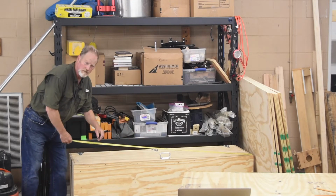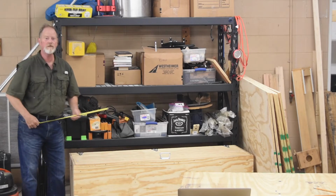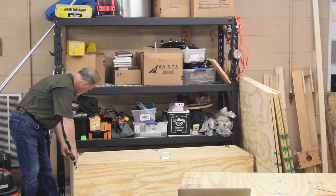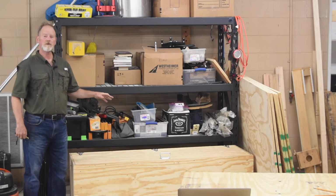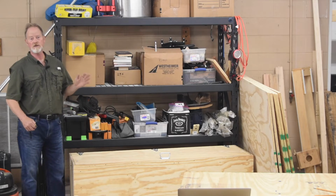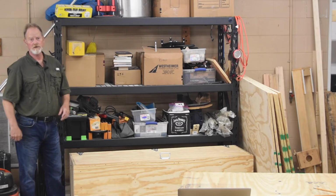We're going to cut these front panels first. They're 70 inches long by 17 deep. We'll cut the full sheet of the plywood, and we'll get these 21-inch panels on the sides for free. So 3 sheets of plywood, each 1 sheet for both of these. I can't get 3 out of them, they're just too big. So it'll be 3 sheets of plywood, and we'll cut these into strips. So let's get over to our sawhorses.